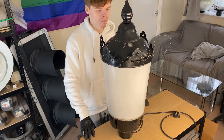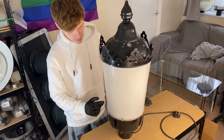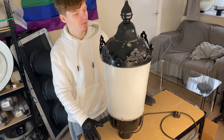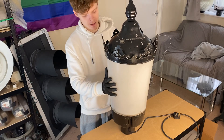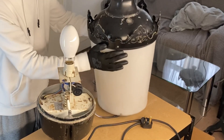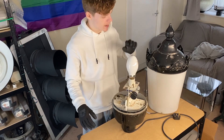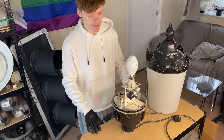You may be wondering how do you open this and what's the design flaw that causes them to lose the upper part? You may notice rivets around the base and up here as well. That is because the bowl, the canopy, the crown, and indeed the acorn finial are all one unit. You have to twist it anti-clockwise and then lift the canopy up. You can see the photocell wires hanging out there — and here's the structure of the lantern. The design flaw is that these are the two nuts that hold on the canopy, bowl, and finial.